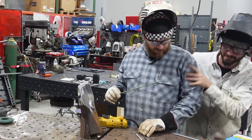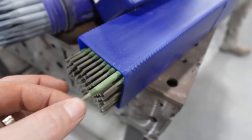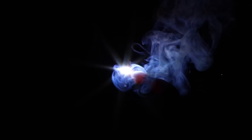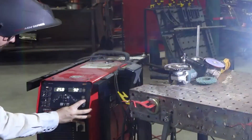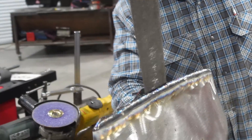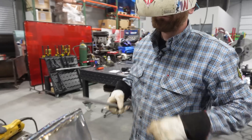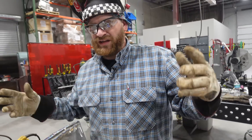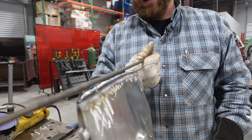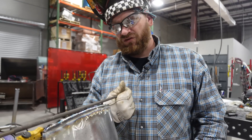Let's go ahead and put that 309 on there — 309 right now — and then we're going to follow up with some hard facing rods. Just one layer needed. We got our stainless stacked and now we're going to lay a nice layer of this tubular Post-Alloy hard facing rod.